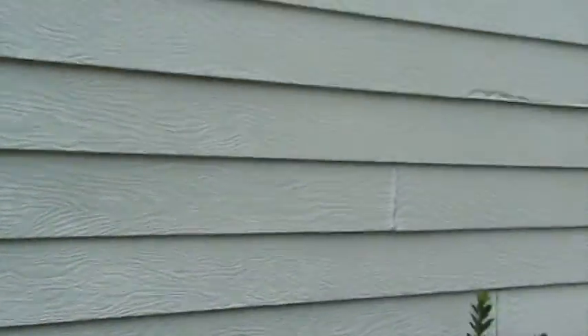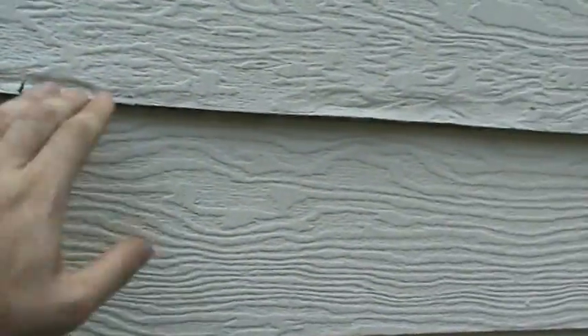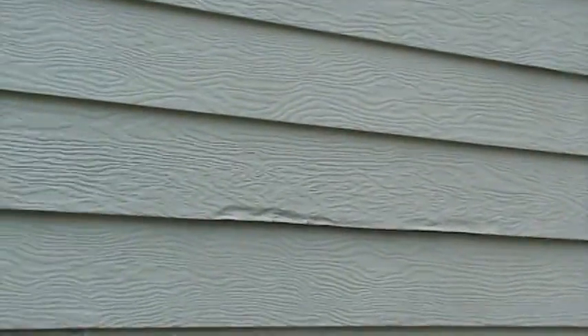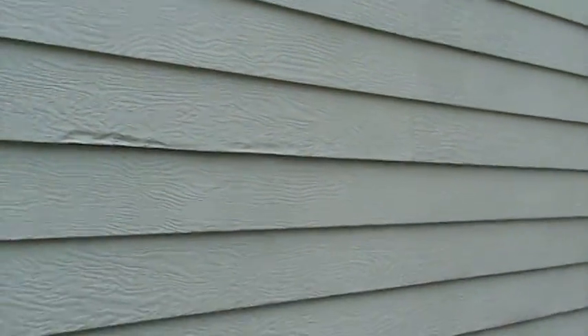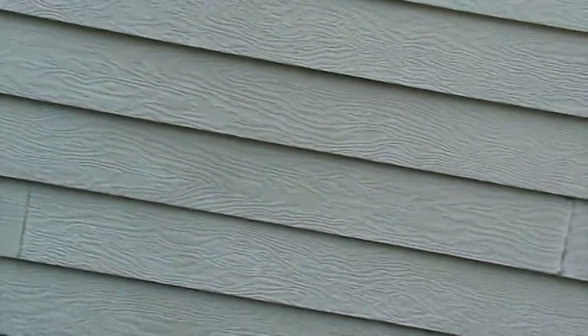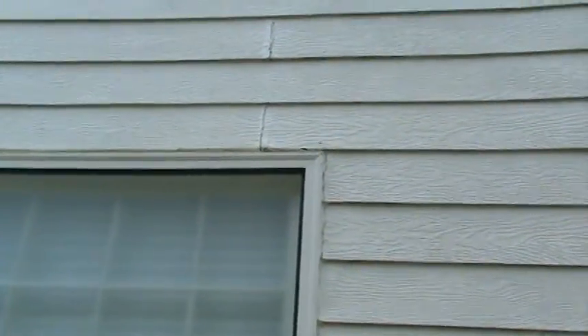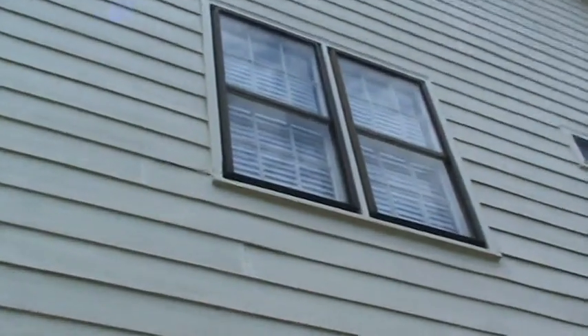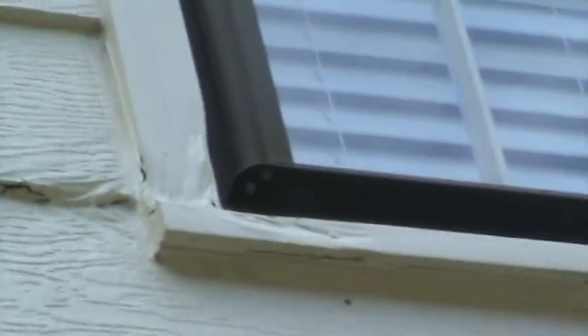We're going to have to replace some siding. When you see this kind of indentation — it looks like a wrinkle, real soft like your skin — this siding has seven layers of cardboard, not wood. When it gets like that, because the bottom edge wasn't hand-painted, it absorbed water and now it's rotted. You can't just piece it in; we'll replace the entire row and feather it in so you won't see the repair. We've got another issue above this window where that whole row of siding is rotted. On the second-story window, you can see that wrinkling from the ground — that lets you know it's rotted out.